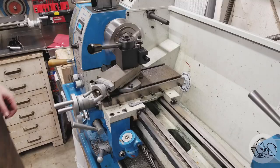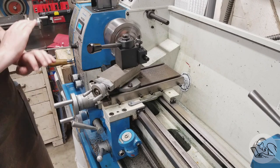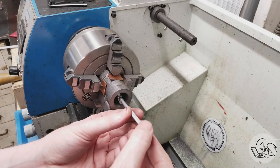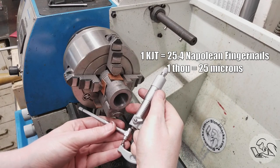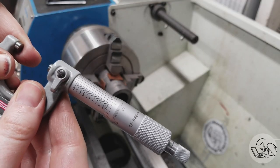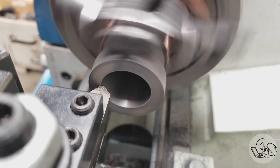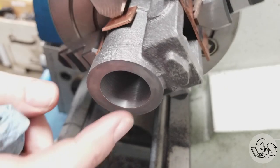We can go ahead and enlarge the bore to the final desired dimension. As long as we don't touch that face and don't move anything, we're going to end up perfectly square. This boring is slow going because you're taking light cuts and slow feed to keep everything nice and straight. The nominal dimension I'm aiming for is one King James thumb, and I'm trying to land one thou under that so I'll have room for honing. We're exactly one thou under. The tolerance on this dimension is zero under and two thou over, so I may end up honing one and a half thou out. I'm also going to break that edge but not chamfer it, because I don't want to mess up the seating of the cylinder head.